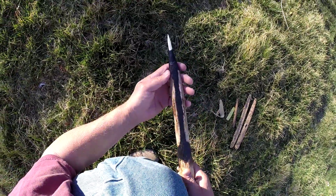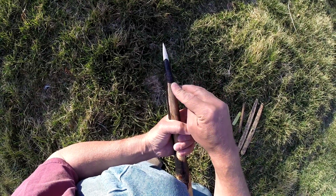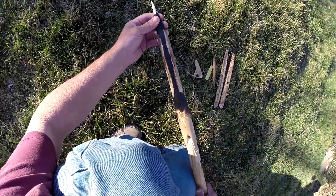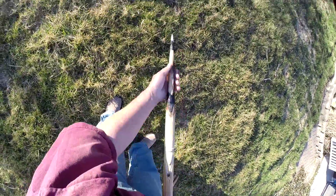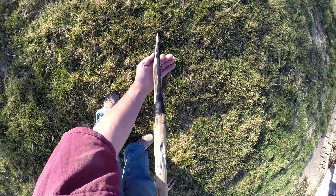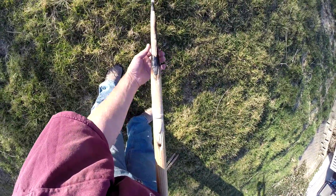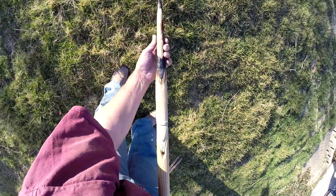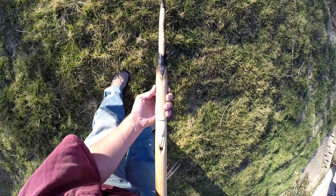I filled in all the grooves with pine pitch and used a flake scraper to blend all the transitions together. There's a nice slender transition through there, a little harder through there, and I have a similar effect on this one — 90 degrees opposite of the forward section. It may actually be the same; there was a very slender, gradual transition originally.